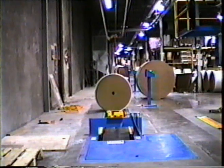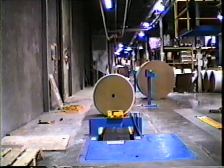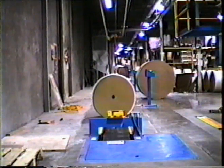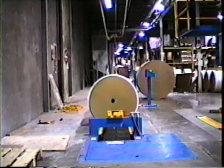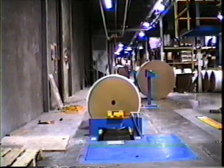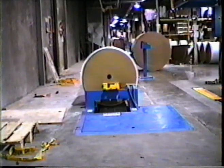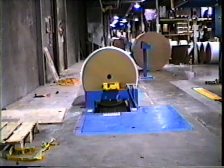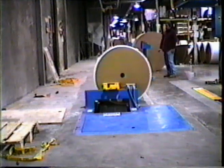Rolls are usually brought into the wrapping system through a series of conveyors. These conveyors use either a heavy-duty belt supported by a roll case, as shown here, or chain conveyors with steel plate slat. Both can be made substantial enough for forklift travel. Roll sequencing and handling can be made automatic and includes kickers, stops, turntables, and ramps to make roll handling easier. These are normally air operated for simpler, cleaner operation. Brinkley integrates the sensors and operating devices into the roll handling controls.